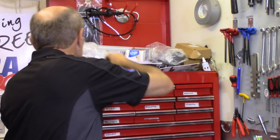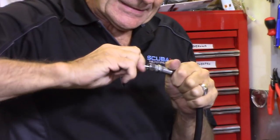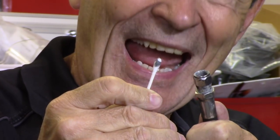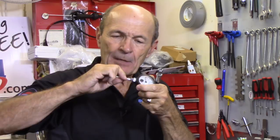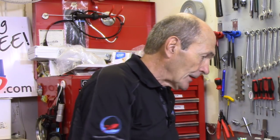Now clean it more — I haven't cleaned it entirely, just roughly gone over it. This is one area where you can actually use a bit of extra grease. Get a Q-tip and force it down in there to clean the hole out. You can actually use that same Q-tip to go up inside the pressure gauge — there will be some dirt up in there too, and you can clean those out. Now: don't be afraid to put a bit of extra good silicone grease — on your fingers is best — put that over those two O-rings and grease them up nicely. Not blobs, but don't be afraid to grease them a bit.